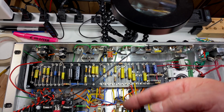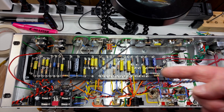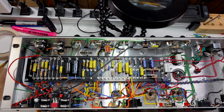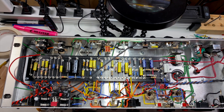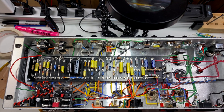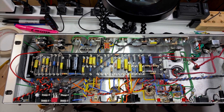I'm going to check all of the offboard wires, make sure we have continuity everywhere we should have it. And then I will connect everything up, check voltages all the way through. If that looks good, I'll put tubes in. If that's good, I'm going to spend the next week playing this and you'll get to hear it next week or the week after. It depends how long this takes. Just thought to give you a quick update today and I'll talk to you all later.